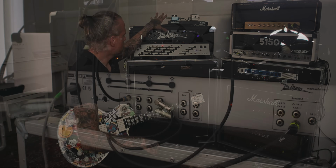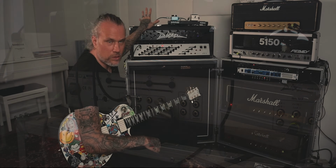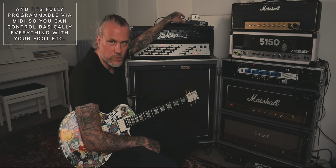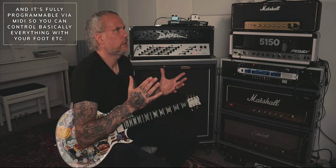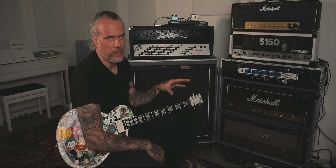4 inserts, so you can have, for example, a chorus pedal on the clean channel, always on there, and put a delay on the lead channel. You don't have to worry. They can be on top of the amp like I have now. The deep switch boosts, I don't know, 80, 90 hertz. The presence, I guess, is around 4K, that high shelf.